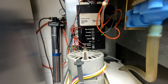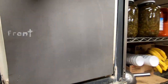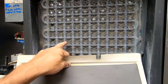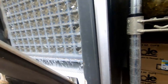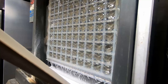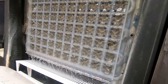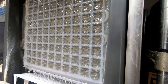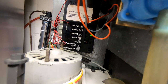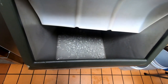We come back down and it's already in harvest. Pretty sure it's about 175, about 85. Pretty thick cubes that should start dropping here. We've had times where they don't fall and they end up just melting away. You can see the clear signs it's starting to release — it's not releasing very quickly. The top ones are starting to melt quite a bit. There it goes. That's the bin sensor working.